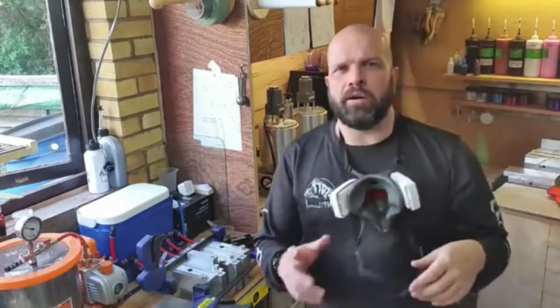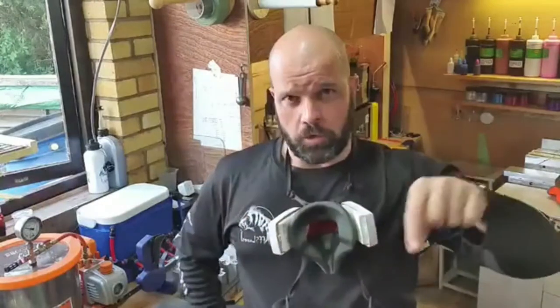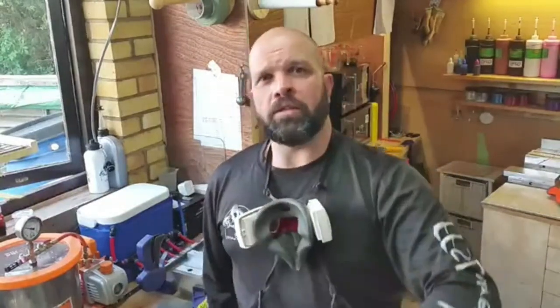Okay, so that came out and it was reading 380. So I gave it a stir, the top layers are 380, the resin is still forming, and as I stirred it, it went all the way down to 320. You've got to get to 350 for it to set up correctly, otherwise you get sticky baits. No one wants a sticky bait.